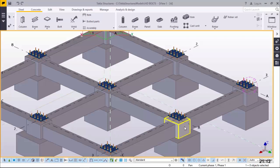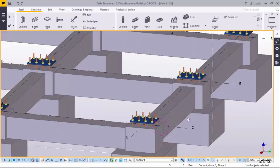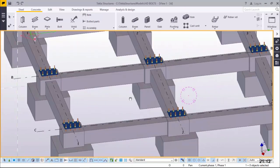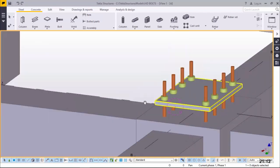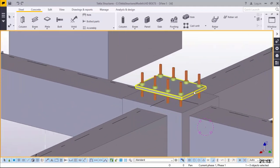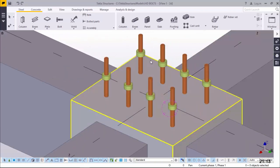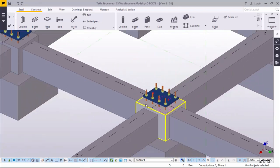The holding down bolts must be installed during the casting of the concrete. That's all for today. Let's just turn this round so you can have a closer look - this is how the HD bolt looks in position. Once the concreting is done, it will look like this. You can then get rid of the plate, your column comes straight down and will be bolted, and after installing your column you can do the grouting. Don't forget to subscribe, and bye-bye.